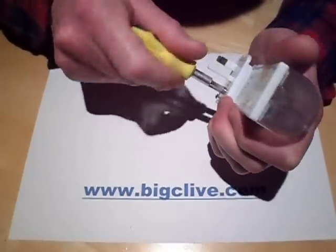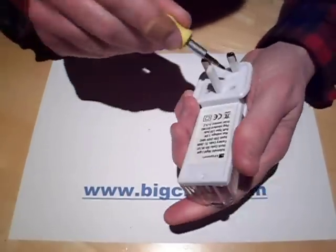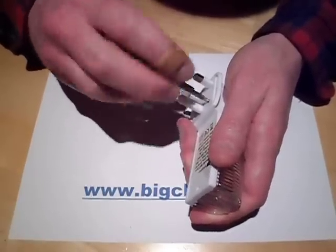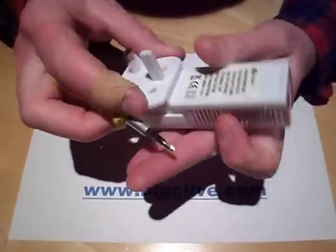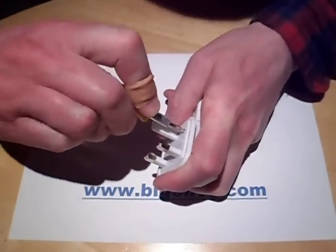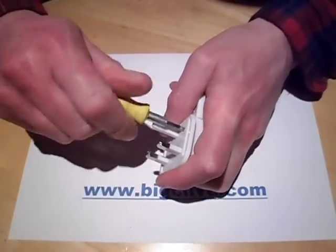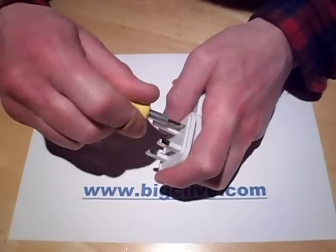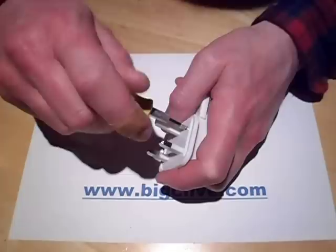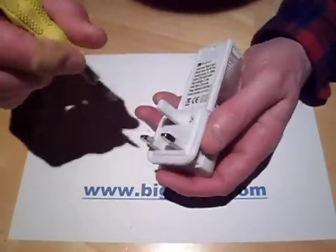These are quite a common style of nightlights. They've got a little LDR on the front so they turn on at night and off during the day. The tungsten type usually have really crappy circuitry — I think they use a thyristor and they tend to shimmer and flicker quite a bit. But at least it saves the life of the lamp, because low-wattage lamps aren't as robust in the UK on 240V since the filament is a lot thinner than the equivalent 110V lamp.